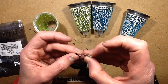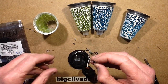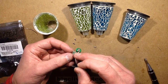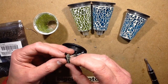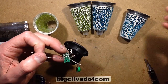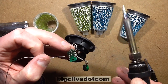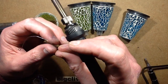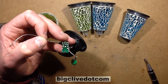The original LED had two bits of heat shrink sleeving — I'm just going to reuse that. It's shrunk rather predictably when it was soldered and they're using it as a crude spacer. It is marked on the PCB, but even if it hadn't been, the negative side of the LED points towards the chip. I'm going to solder one of those connections, line the LED up, solder that connection, straighten the LED up a bit, then solder the other connection before using snips to trim the leads off.